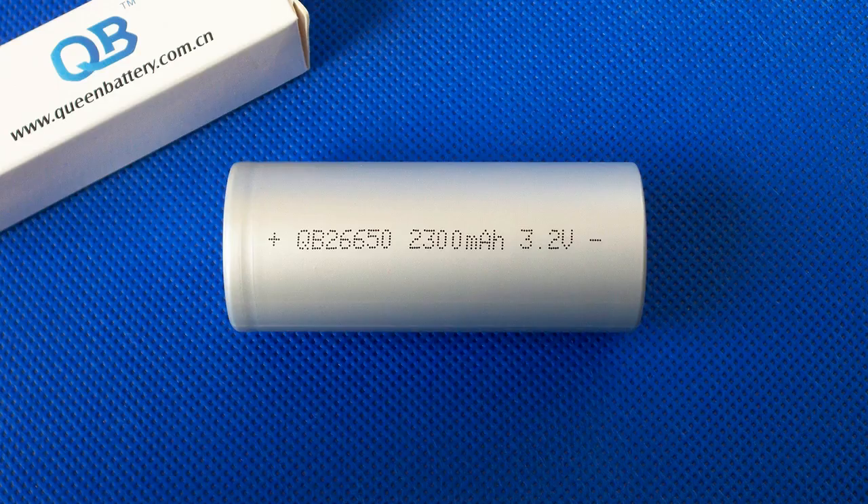So what can I say at the end of the day? The QB26650-2300 is not just a very good cell — it's a fantastic cell which could be sold as a 2800 mAh one. Its real capacity is 500 mAh or 22% higher than declared. It doesn't go close to 2300 mAh even at 20 amp discharge, remaining above 2700 mAh. And the final advantage is its price, which should be half that of the 2500 mAh cells and one third of the price of A123 System cells. To check the actual price, drop an email to the supplier.